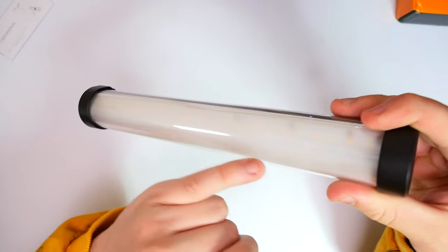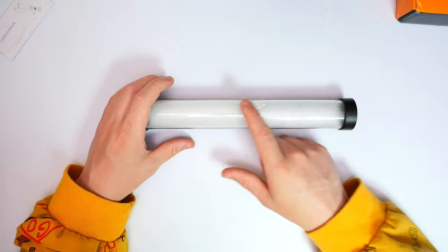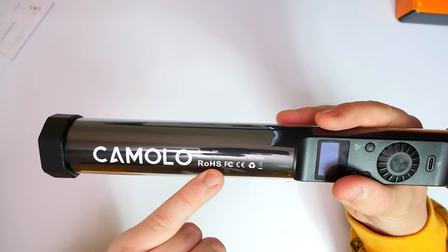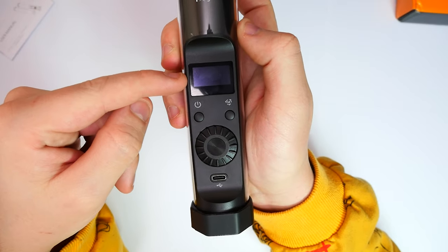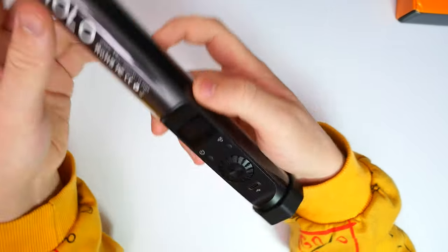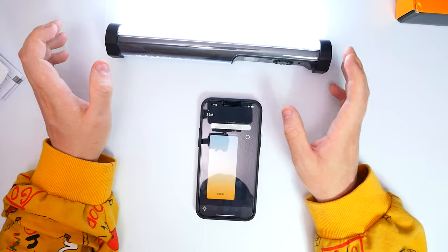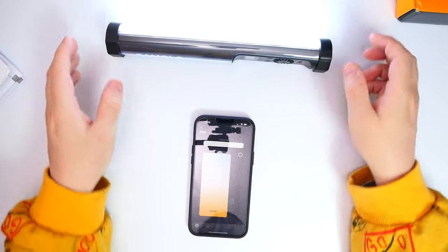The light itself is covered entirely in a clear acrylic plastic, and inside we have a dome diffuser which takes away a lot of the harsh light coming from the LEDs. Inside we have two different tones of LEDs — a white light and a warm light — which is pretty cool. There's also information indicating the power is eight watts and the battery is a 2600 milliamp-hour battery, which is pretty large. On the controls we have a mini LCD display, an on/off button, modes, a turn wheel, and a click button, as well as the charging port. I turned it on, saw a Bluetooth sign, grabbed my phone — and we are connected!